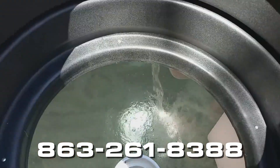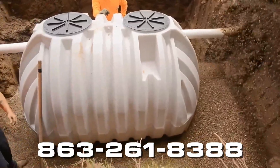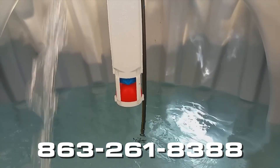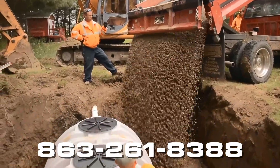then start the addition of water and add approximately one foot more gravel mixture around the base of the tank. Continue to add the water at the same rate as the aggregate backfill material. Continue the backfill with gravel mixture up to the top of the tank.